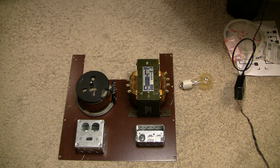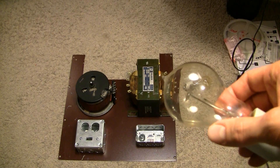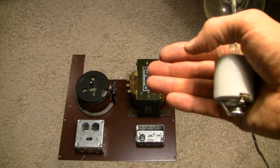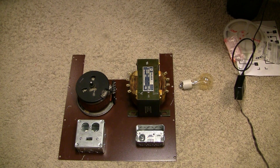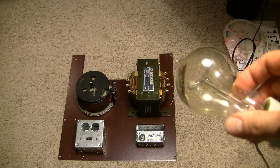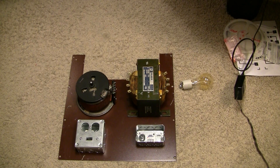These aren't going to be isolated — they'll be right on the line side. The reason I'm not having them on the output side is I have 120 volts coming out of this transformer and 240 volts going into the other box. If I put these light bulbs on the isolated side, they'd get switched into the 240-volt winding, which wouldn't make these two 120-volt light bulbs happy, especially in parallel — any kind of current and they'd just burn out. By having them just after the Variac, going into the primary winding, they'll never exceed 120 volts.